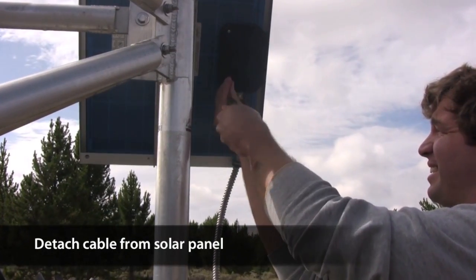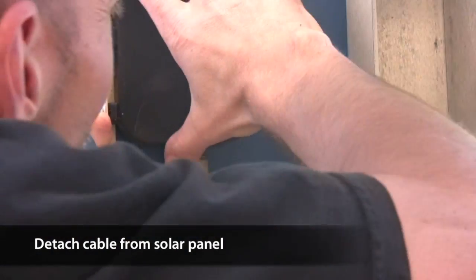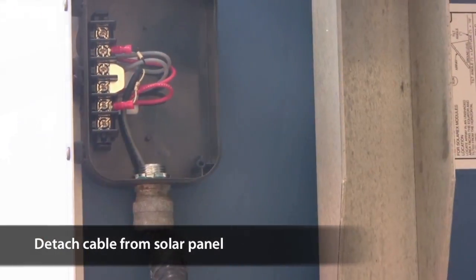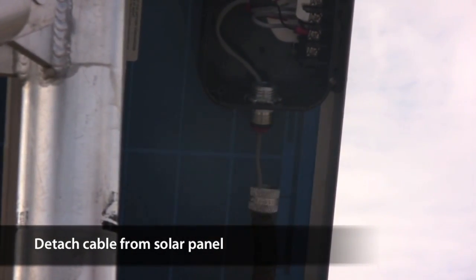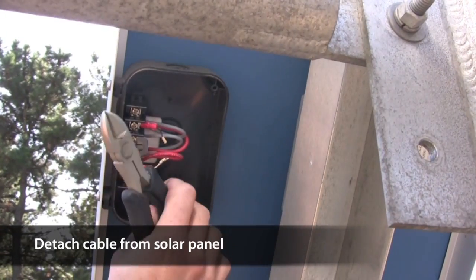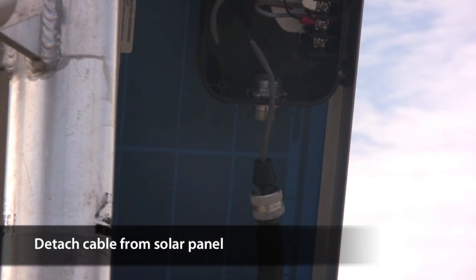The solar panel will also likely remain, so the cable must be detached from it. Unscrew the two screws holding the back plastic panel on, then very carefully remove the panel. Unscrew the knurled nut from the metal fitting so the cable can slide out. Once you have access to the inside, use wire cutters to cut the two leads, leaving them in place for now as it will help you to easily determine which is positive and which is negative later. Use pliers to pull out the rubber moisture blocker, then pull out the cable, keeping the fittings for later use with the new cable.